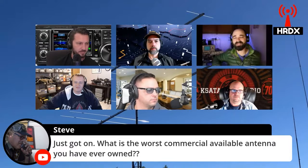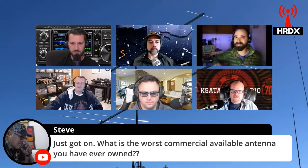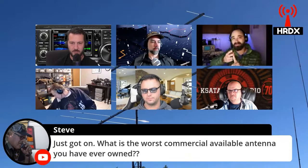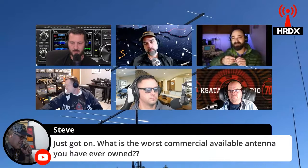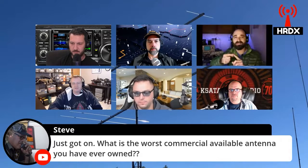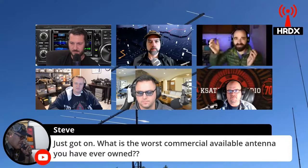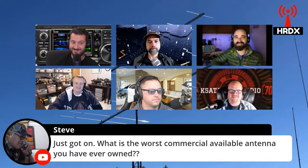There are some characteristics of antennas that are competing factors. If you want to smell the BS on an antenna advertisement, look for these three factors: the antenna size, the antenna's bandwidth or broadband or multiband functionality, and the antenna's efficiency or gain. You're never going to have a small antenna that's broadband and high gain — it just does not exist. Each time you sacrifice or gain an advantage in one of those, it's a trade-off on the others. That's why I keep building larger and more ridiculous antennas to bring up to mountaintops — size does matter when it comes to antennas if you want performance and broadband functionality.